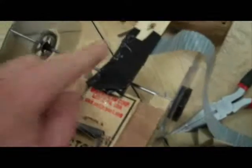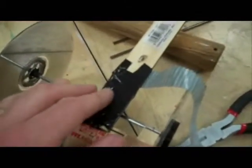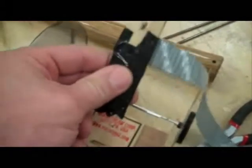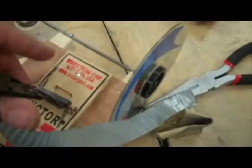That's how I designed my car, to be a 12-inch roller, and that's why I made my car frame that length. Probably one of the hardest things to do is to attach this arm to extend your arm and keep it secure. You notice I drilled a hole through this roller. I'm going to bring that mousetrap up. I clipped it. Also, I'm using duct tape and I'm going to use some wire. That has to be real secure wrapped around there. That has to be an extension of that arm. It just can't be flimsy or it'll never work. And you're going to put some torque on this right here. So you noticed I used almost the full length of the mousetrap, but I can't interfere with the spring hatch here.